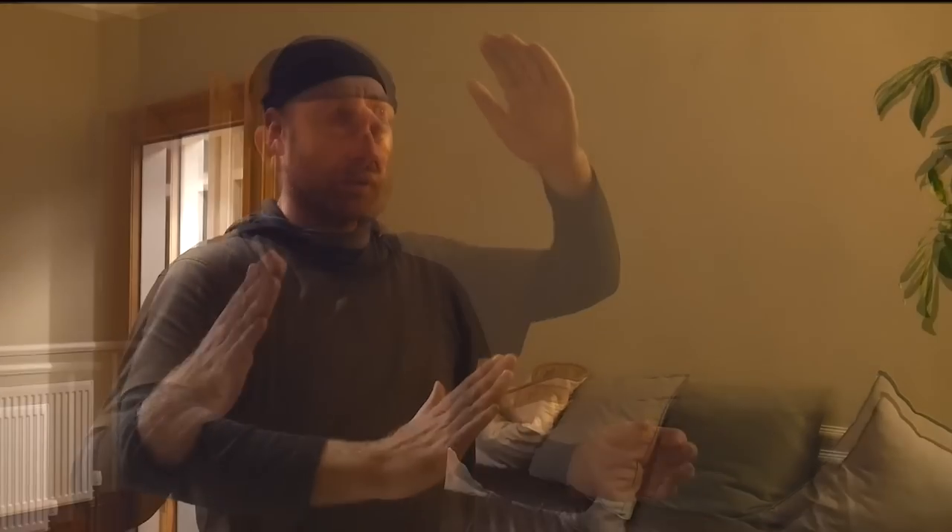If you make it too large, it will bow in on itself and you'll get some flex in the film, so gaps will open up — which isn't ideal, but if you're taking it out anyway it's not really the end of the world. Even if you put it in and it is too big, you can just shave it off. Most of the workflow is just getting in there — these window frames are never perfectly square themselves.